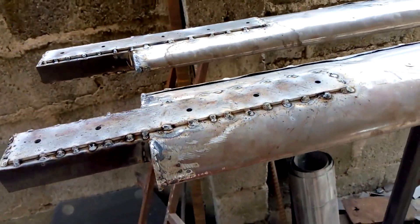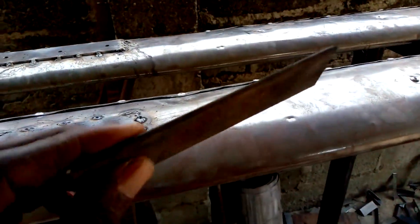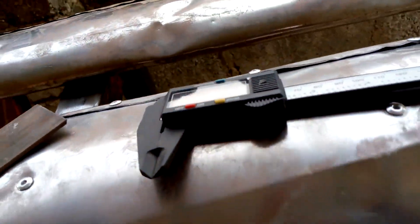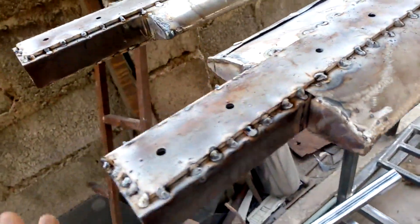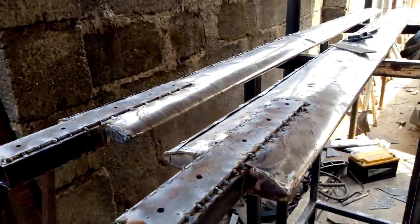In order to add more strength to this particular place — from here to here, about 30 centimeters — I added a 1.5-inch flat bar, 2.7mm thick. That is exactly what I'm trying to show. I used a digital vernier caliper to take my measurements. I added strength here, and we have one piece on top and one underneath to reinforce the connection area.